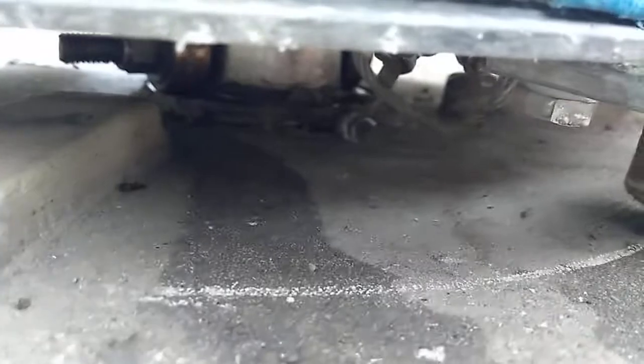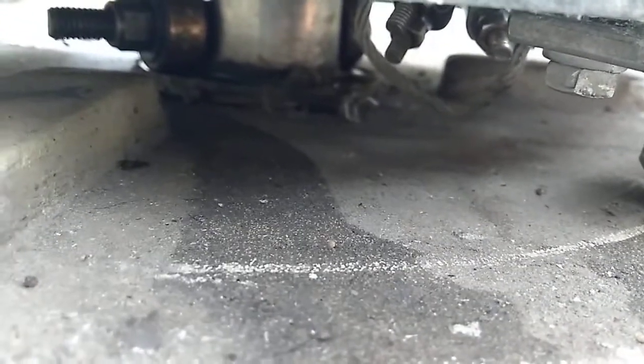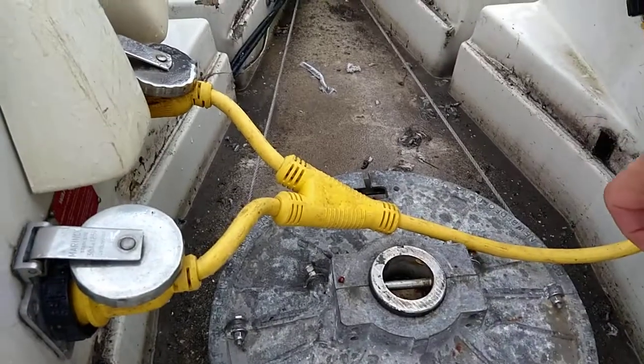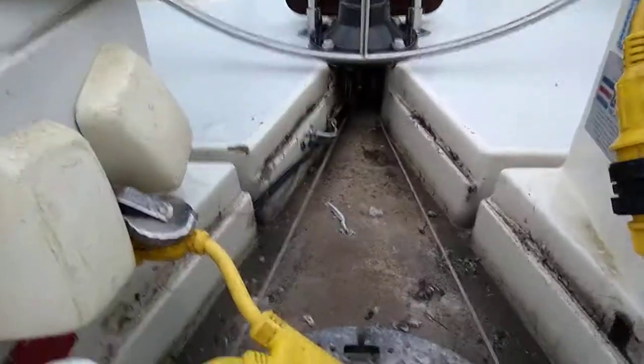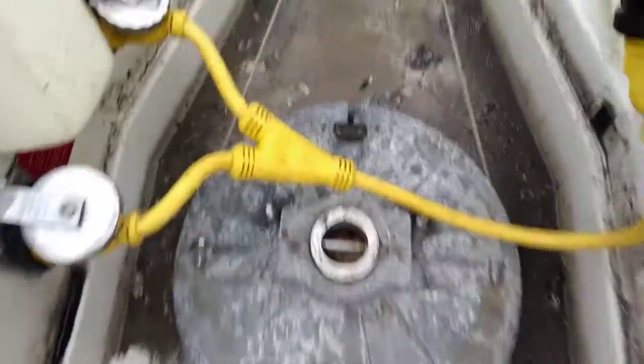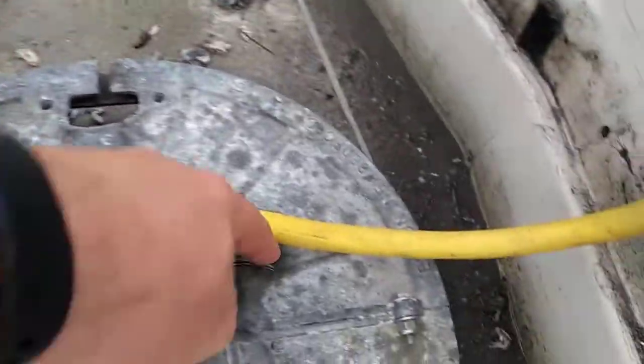You need to sight a line and make sure it's square and even. There's a set of rings — brass bushings — down there underneath the bull gear. That single bolt comes out and that would allow the rudder to drop. You need to remove the bull gear, and then there's nothing else besides that nut and rings holding the bull gear in.